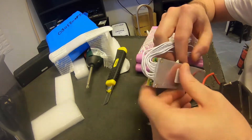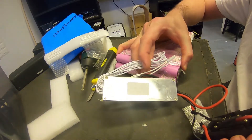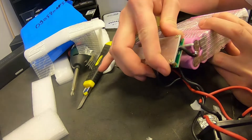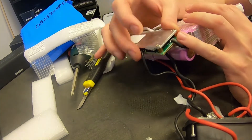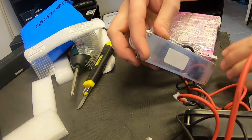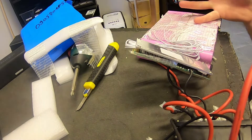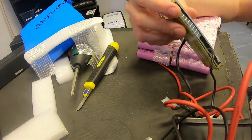It's a fairly large BMS with a temp sensor. This is complete idiocy — it's not the first time I'm seeing this. You have the battery minus, and on the BMS it doesn't say 'battery minus,' it says 'discharge minus.' The discharge minus goes from the BMS to the discharging minus port — but instead they connected the battery minus to the discharging port. The B-minus — battery minus — does not go to the battery minus; it goes to the discharging port. So this BMS cannot protect the battery cells from over-discharge — it does not have this feature when you mix up these very important wires.